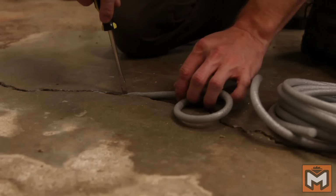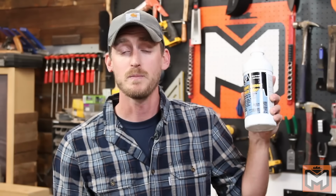Next, you'll need a liquid crack filler. I'm using this liquid cement crack filler from DAP. Now, full disclosure, DAP is a sponsor of mine, so I use their products as much as possible. However, I also believe that this is a perfect product for this application because it's highly elastic and it's self-leveling and ready mixed. So when you put it in the crack, if the concrete continues to move down the road, the repair will stay in place.